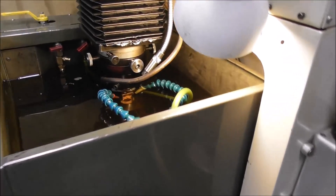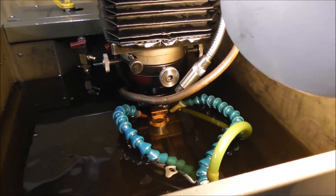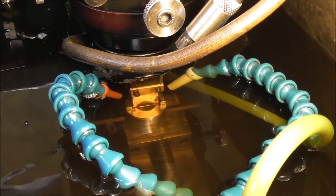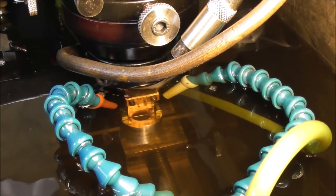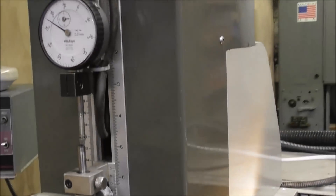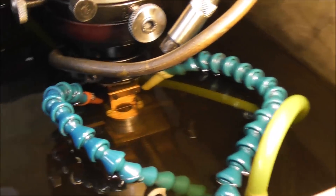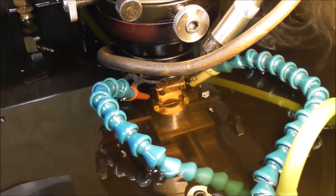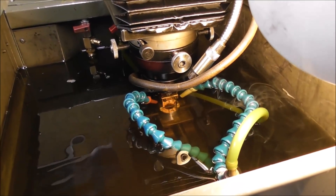It's going down on the second one a little bit quicker and smoother because the sharp edges of the leading edge of the electrode have worn down, and there are no little pockets for the sludge to collect in and cause arcing. As long as it's running automatically, I can go away and do something else — one of my favourite little phrases.